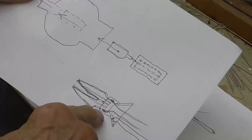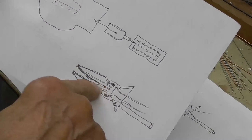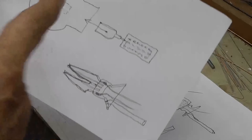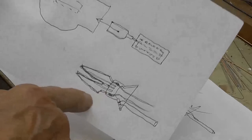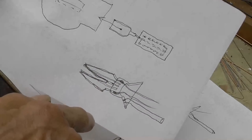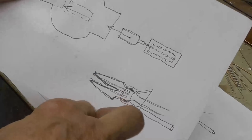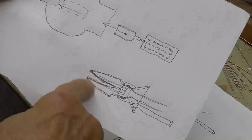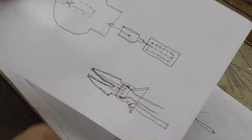Okay, so first thing to do is to make the pinch for the filament. We have to have a total of 5 wires. We have 3 support wires that are just buried in the glass, and then we have the 2 feed-through wires for the actual connections to the ends of the filament. And then the filament will just be a W-shaped piece of tungsten that just zigzags between the support wires and the terminals. I've already tried this design and it works very well. It's easy to coat with the oxide material. We'll do that, and it generates tremendous emission because of the amount of surface area.